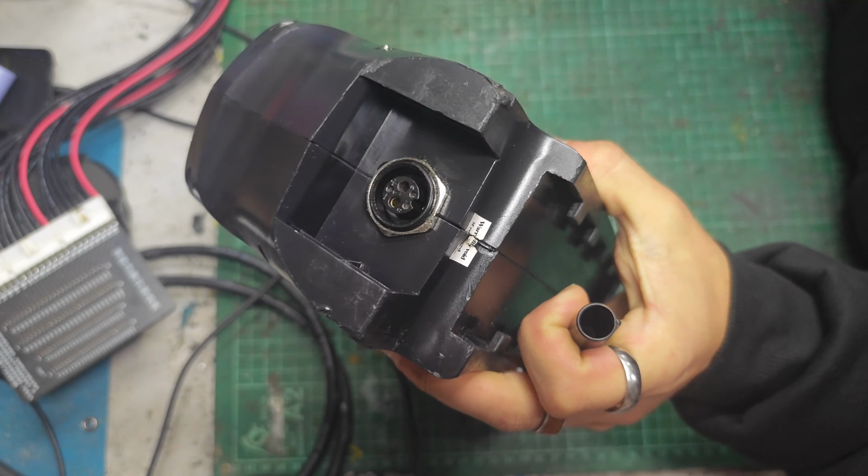So, what's going on with this one, it would appear, is that the guy's bike isn't working. It's a Bafang 1000 watt mid-drive, so a BBS HD, that must be. If you can see, this here is all nice and shiny. I can stick my screwdriver in it. This one is all melty and bad, and the contact, I think, is just gone, basically. You see the blackened mess that's come up on the end of my screwdriver there? I'm pretty sure that's what the problem is with this.